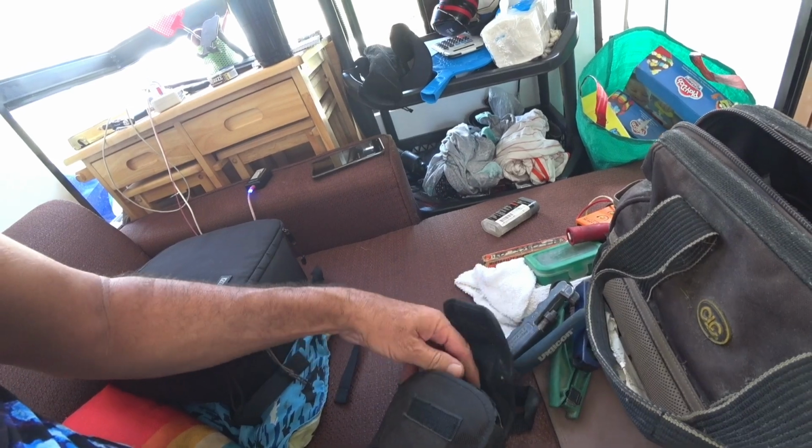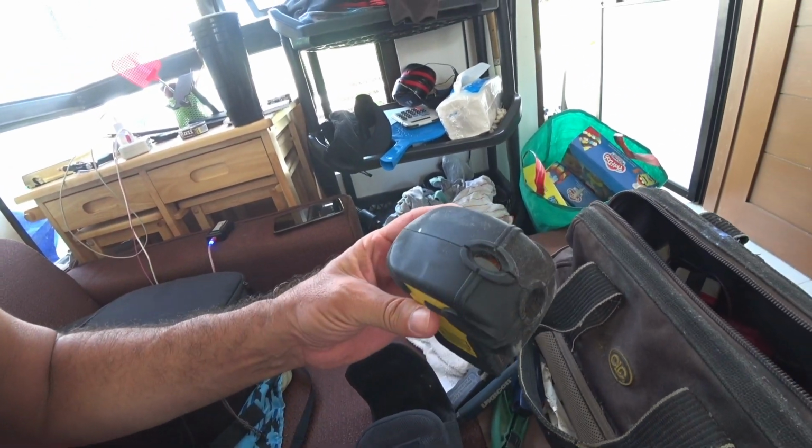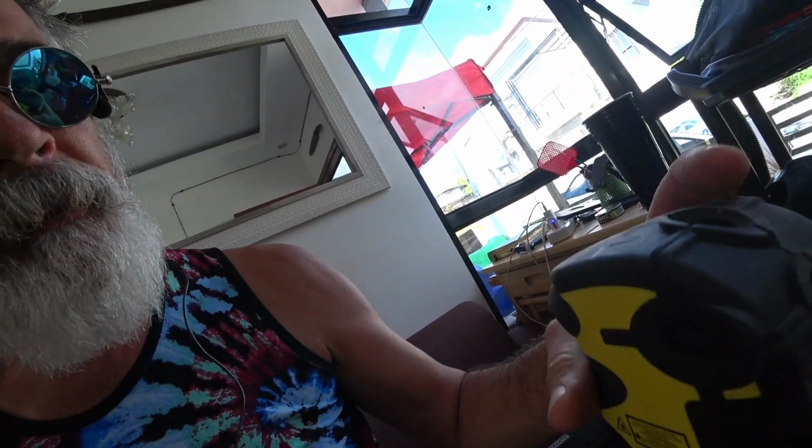But this thing right here, I bought this quite a while ago. It's a little laser thing, and when I would be doing panels, especially out in California, you might have to cut up through the roof. You leave the old stub there, and then you'll mount the panel on the outside of the panel that's there. You could set this up on top of the panel where your riser's going to go, and it shoots your little laser down, and then this one will shoot the laser up. That way, when you go to core the hole into the roof, it's perfect, and your pipe's not going to be crooked. I've seen guys doing it, and they'll measure, and they get it off a little bit, and then the pipe's crooked, and you want that good and tight.